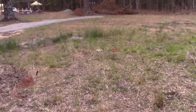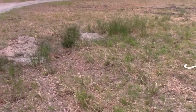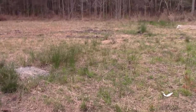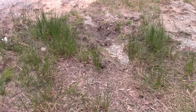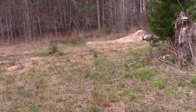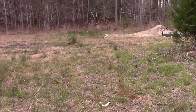So let me share a little bit about where to choose to put a well. Usually if you have two hills, you kind of want to put it in the valley where the water runs off. So if your land has kind of a low point, that's a good place. But look at my property here, and do you see the reeds sticking up? The reeds are where the water is. And you can kind of use some common sense, because these reeds, they're swamp reeds. They like lots of watery land. So I know that the water is kind of running in this direction and pooling here, which helps get you an extra little bit of water.